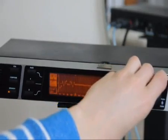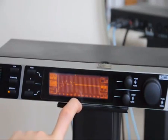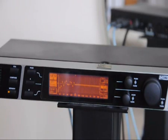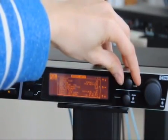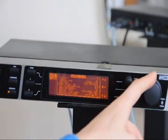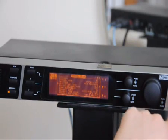There's nothing above about 300Hz because we didn't want to apply EQ there — it would drastically alter the tonal characteristic of the system and probably just sound strange. Now there is one more very important step. Go to the Utility menu, bottom left hand corner on the right hand control panel, and use the top control knob to come down to the setting which says Gain Offset. If you've applied 6dB of boost, a signal that would have hit maximum level will now overload, so turn the gain offset down to minus 6dB. This prevents clipping — it's one reason many people don't like the EQ sound after finishing, because they forget this step.